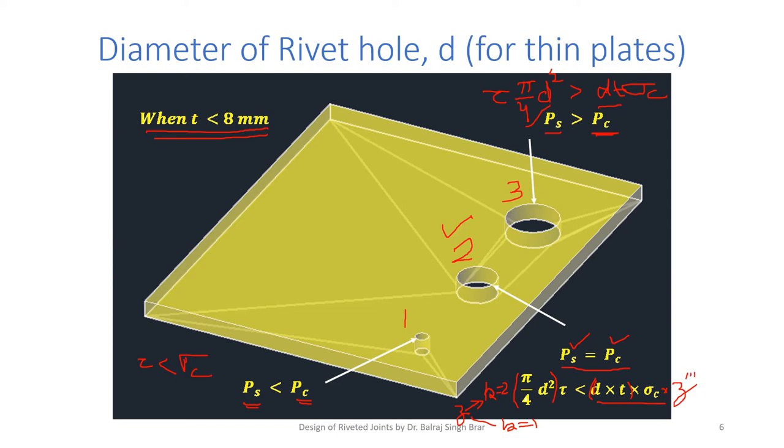Z3, Z1, Z2. So we have to take care as we discussed already. And now T is known, sigma C is known, tau is known. We will be determining the rivet hole dia. So this is the design procedure to determine the rivet hole dia. From the standard table, as discussed in the earlier lectures, we will select the standard rivet size and standard rivet hole size, and we will proceed with the